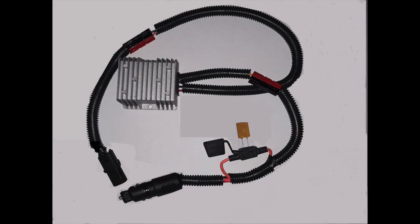The weather pack connector is optional, but makes it easy to disconnect and reconnect the output of the boost converter to the solar input jacks of the charge controller and prevents accidentally reversing the polarity of the wires. The red-black Anderson connectors, also pictured, are not required, but I introduced those to make it easier to test and experiment with this circuit.